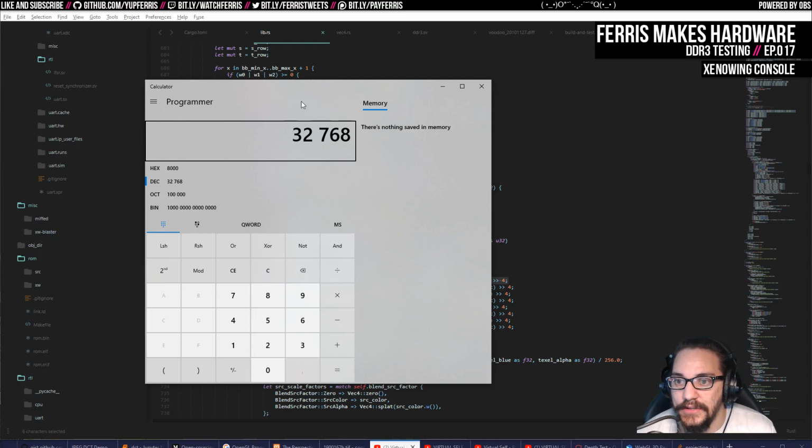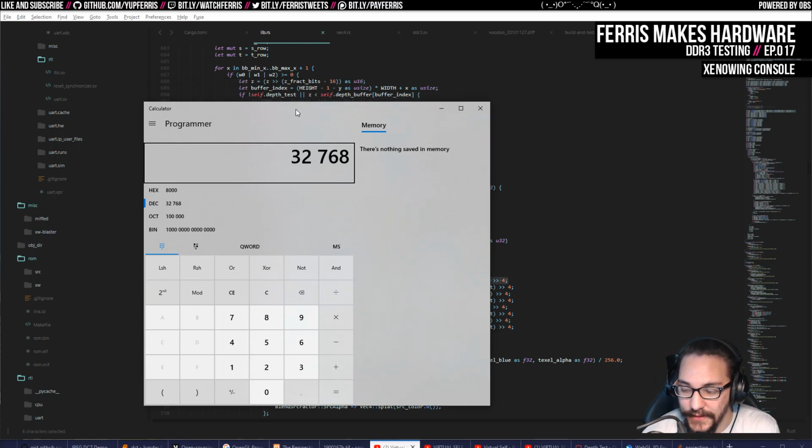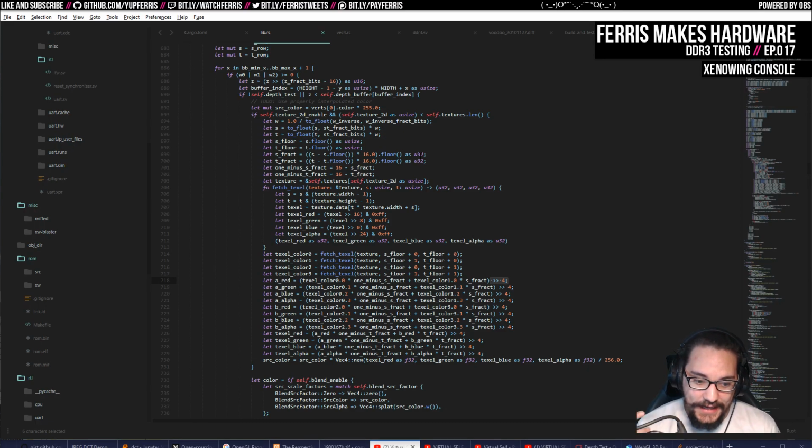we have 32k of cache just for the textures, which on one hand is kind of big for the FPGA. It's not huge, not really an issue, but it's kind of big. On the other hand, we have to move that in and out of the texture cache, and that might take a long time. So that's already fairly large, and then 32 bits per pixel would be double that. So I had chosen those parameters, and I was moving everything, and it looked so bad.